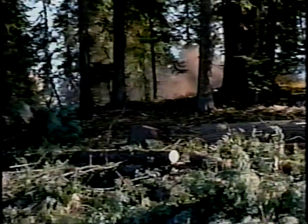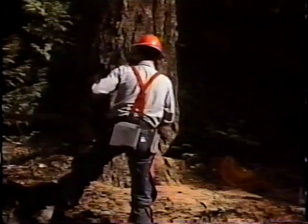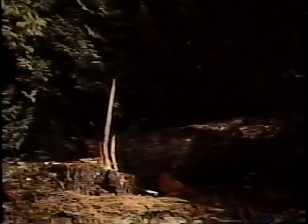The height of the face is more important than the depth of the cut in controlling the fall of the tree. Remember, control is the guiding principle of the physics of falling. The right cut will direct the tree where you want it to fall and maintain control of the fall until the physical forces acting on the tree make it unlikely that it will end up anywhere but where you want it to land.